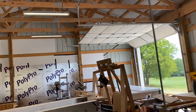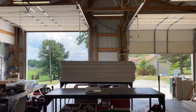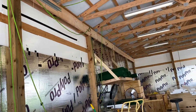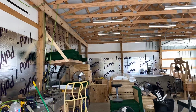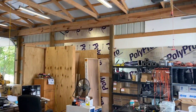I'm really happy with it. For about $1,700 and two days' work, I'm going to insulate this 30 by 50 building, and I'm pretty happy with the decision I made to go with this. For the price compared to the R-value, I think it's going to be really good — you're getting between an R-12 and R-16 out of these two layers, and I don't think you're going to get that R-value for that price any other way I could find. Thanks for watching.